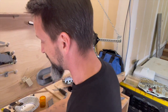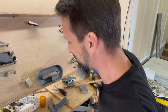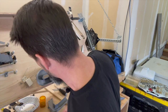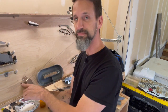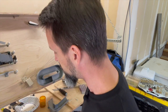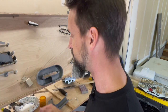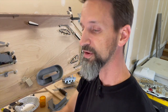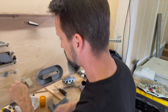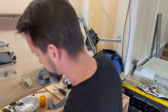Another reason to do all this in CAD and Visual Pinball Designer first, so you know exactly where things are going to fit. Okay, so I went through and I pre-drilled, kind of like a pilot hole here, all the way through. Just a little bit smaller, about 11/16, and we're going to have this post go through. And this post, with a 1 1/4 plastic bushing, will come down. It'll help protect from the ball coming back this direction also.